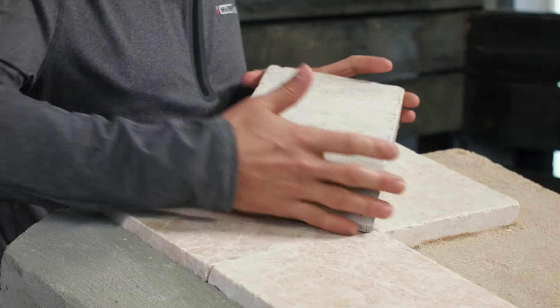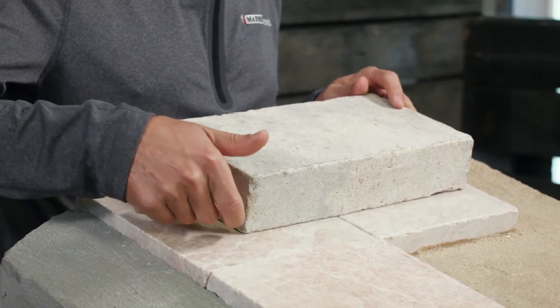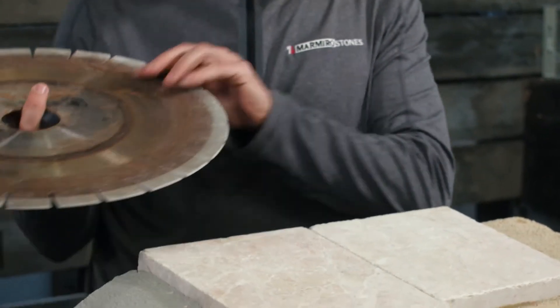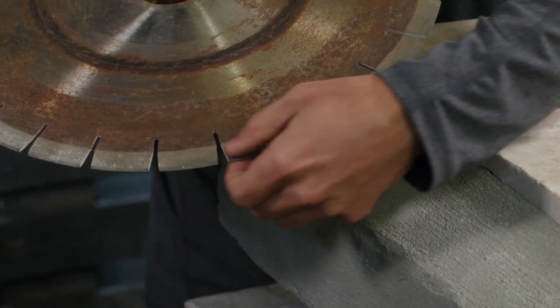We're going to lay this with either a tight joint, but if you want to achieve a higher vertical interlock, you can gap each piece out a sixteenth of an inch to apply your jointing sand. When cutting any of your marble or travertine, you want to use a high-quality diamond blade — make sure your blade is segmented.